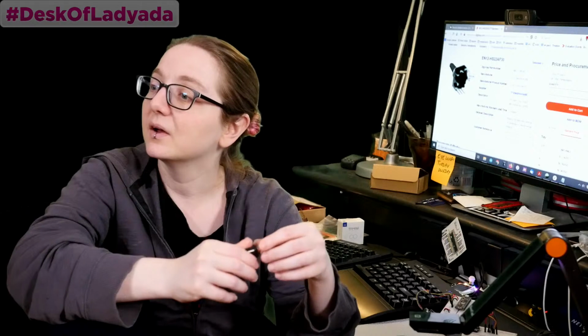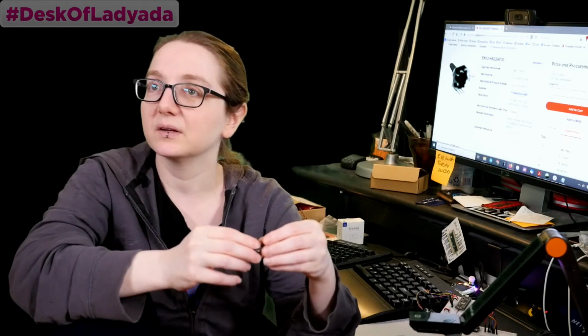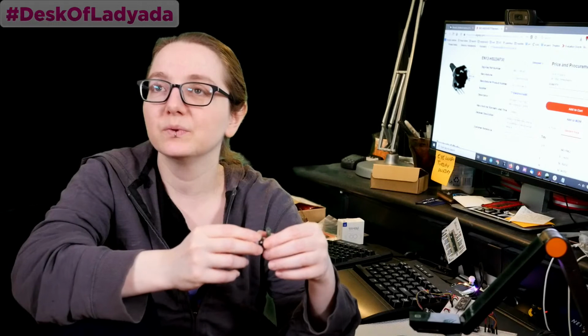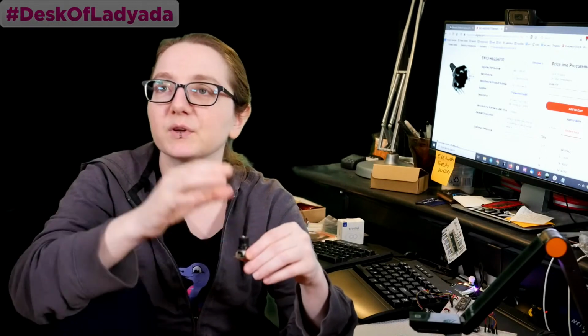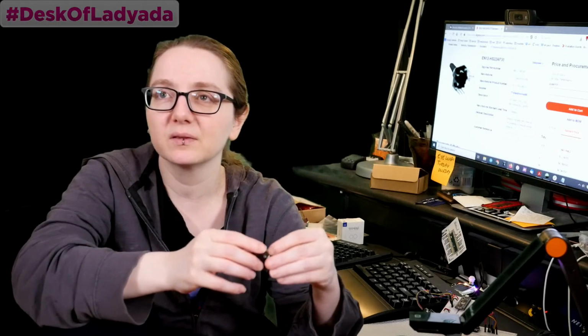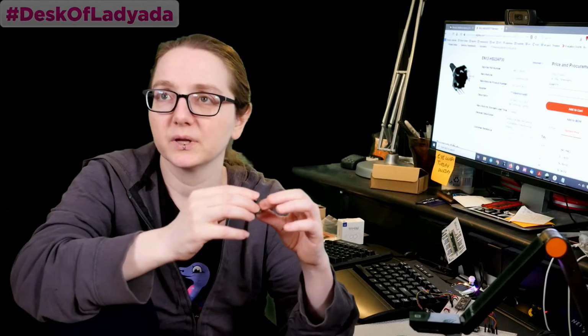Oh, one question. Are there plans for a rotary wing? No, not yet. But I'm thinking about different ideas. The thing about rotary encoders is there's a significant amount of code you have to write for them, and so if there was one, I'd have to make sure that every platform has code for it and I'd have to write an example. I was thinking that's when I might just say, hey, we'll make a little I2C adapter for like two or three rotary encoders in a row. That could be kind of fun.